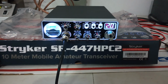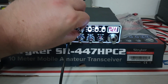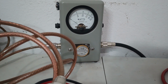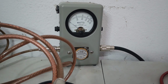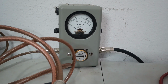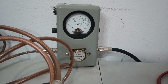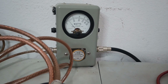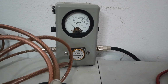Again, 14.6 volts, and we'll go ahead and turn our RF power wide open here and come over to the bird. 250 watt slug, top scale, so that 20 is 200, which we won't be going that far, but just for reference, 10 is 100, 15 is 150. Average power first. So it looks like we're rocking on with about an 18 watt dead key there, give or take.